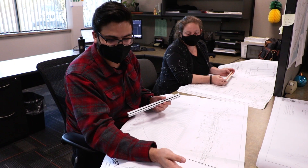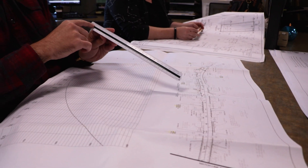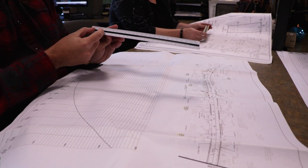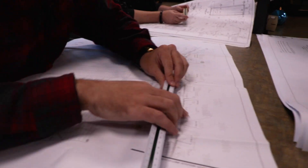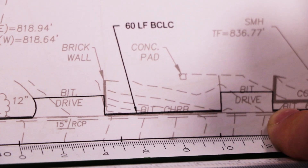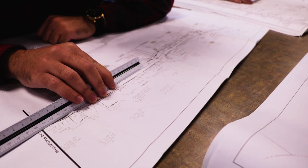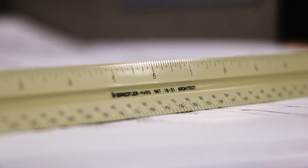you look at your drawing — this one is at one inch equals 40 feet — you go onto the scale to the side that says 40, which marks out 40 feet for every one inch. Then on the drawing, you measure in between your two station points and you can count out one, two, three, four, five tick marks — that represents 50 feet. Perfect match.